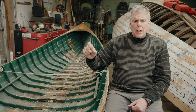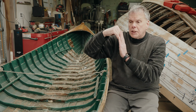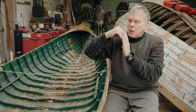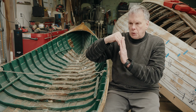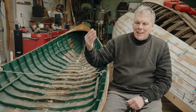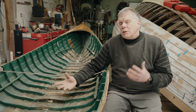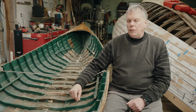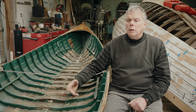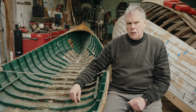With a lap strake, where the planks lap, it forms a nice rigid spline longitudinally in the boat. So it gives it a lot of longitudinal stiffness and strength. And the likelihood that you're going to impact these small planks in the middle where they're not supported is probably fairly small if you're careful. I'm not too concerned about it with this particular design because we will be careful with it. We won't horse around on the side of the boat. We know that that's a potential weakness.